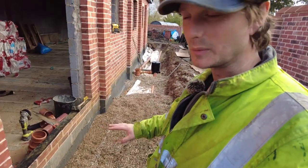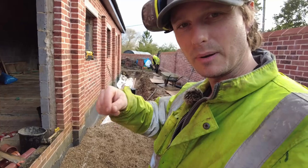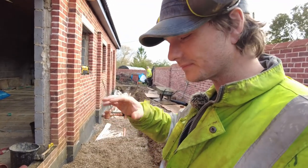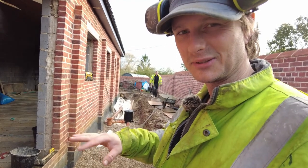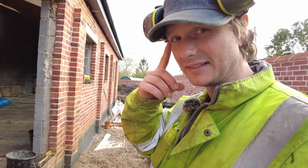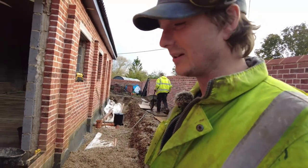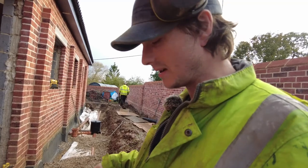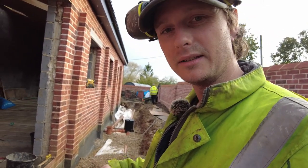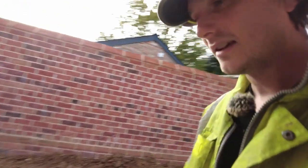We've decided to cover them up. Sole reason being is because if we leave it partially exposed, the pipes were quite easy to just move. If you walk up and down, then they just go out of fall, and it wasn't good. I got very stressed because I ended up setting the soil pipe, and then I ended up pulling the French drain out of its fall.